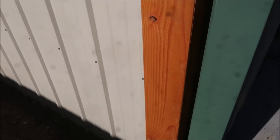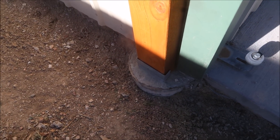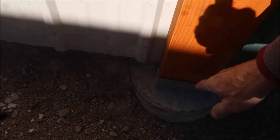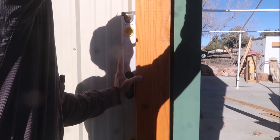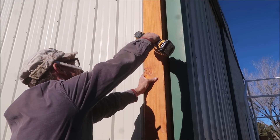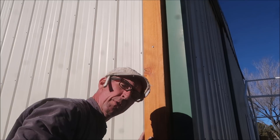You can see we've taken time already to pour our piers — they're 12 inches by 2 foot deep. We set some Simpson strong ties in here to fasten to our posts. That's what we want; we'll do that on all three of these.